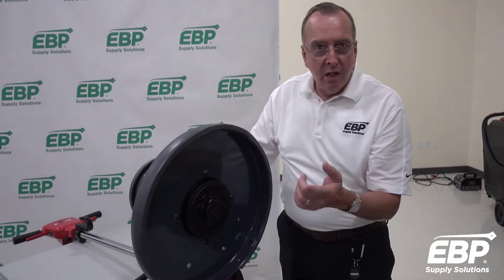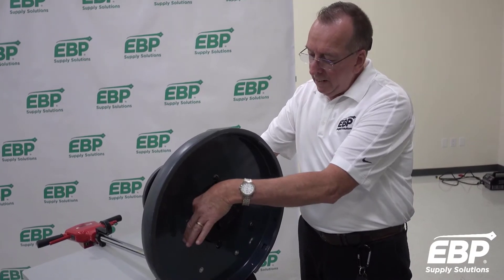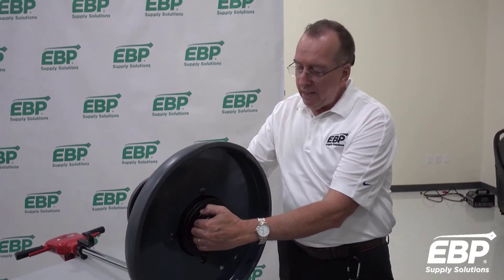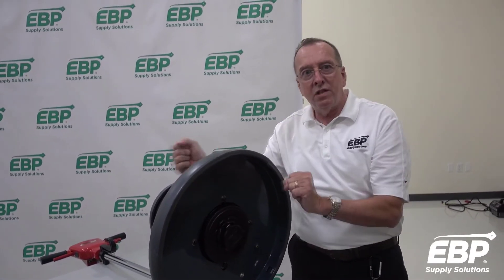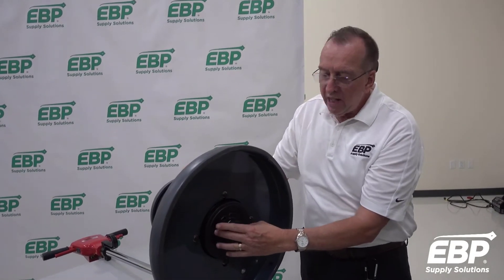There are some machines that sell for really low money that have one planetary gear running into the motor shaft, and that single planetary gear is very unbalanced. All the work is on one side of the motor, one side of the planetary gearbox, and you will get failure.